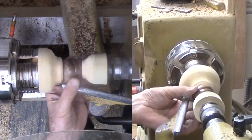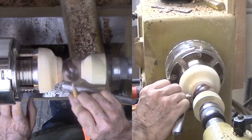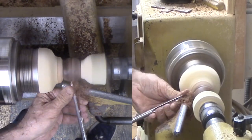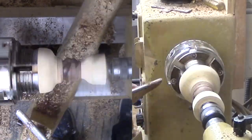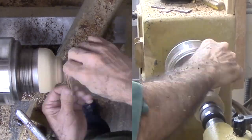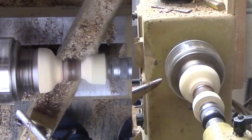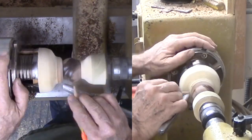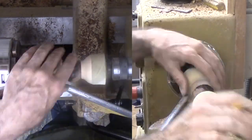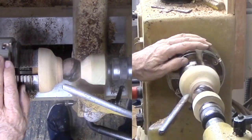Now to align for the second set of marks. The second is not too bad — the top and bottom nubs are gone. This will be more critical on future rotations since I will always want to cross at the same top and bottom points. Then cut, sand, and finish. Now the third set — same thing, three more after this. Then a problem develops with the previous grooves: it is a little more difficult to seat the sphere, but still very doable.